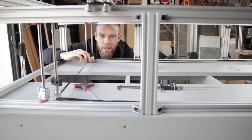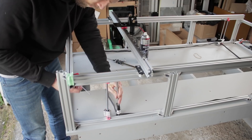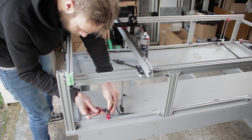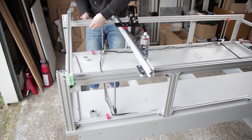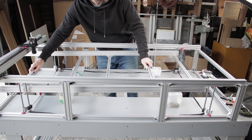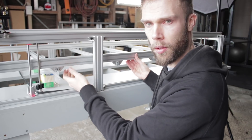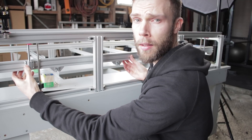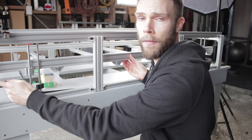The bolt is just a tad too short but that's fine — we're just going to move the assemblies here about 20mm in this direction. I've left these fittings a bit loose to give me some wiggle room across this rail. The reason I've done that is so I can lift this bearing block up, screw that down to the rail across both ends, and then that's going to dictate the overall width of the bed. Then I can go through and fasten these down afterwards.